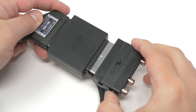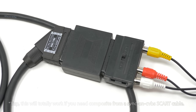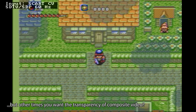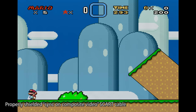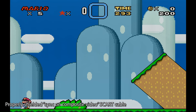There are two reasons for using composite video as sync. First, someone could buy an RGB SCART cable for their console, but if their Japanese or European TV only supported composite video through their SCART port, it would still work — and devices like the RetroTINK 5X can support both RGB and composite over SCART today. The second reason is safety. On an oscilloscope displaying a color pattern, you can see the color and brightness information along with the sync square wave at the bottom — all part of the composite video standard, which all SCART devices are designed to accept. Because of the safety and the bonus of also passing composite video, everyone probably should have been using composite video as sync, provided the cable was properly shielded.